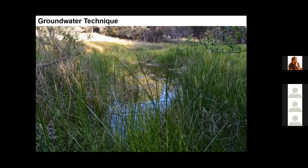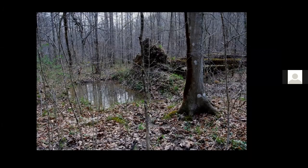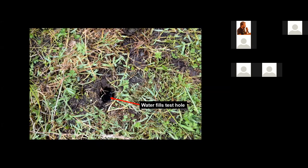Now we're going to look at another technique I've developed — the groundwater technique for building wetland areas. The groundwater technique is used on sites where the water table is close to the surface. Here is a groundwater-supplied wetland we built at the Southwestern Research Station in Arizona, an arid desert region, built on a site supplied with water from a spring. How do you know groundwater is near the surface? You may see it standing in the depression left when a large tree falls over. If you dig a small diameter hole and water enters, then you know groundwater is near the surface and the groundwater technique may be used.